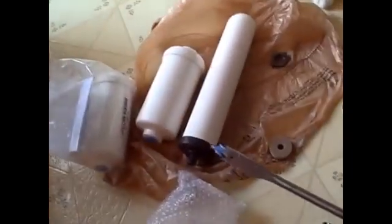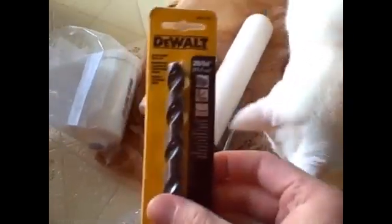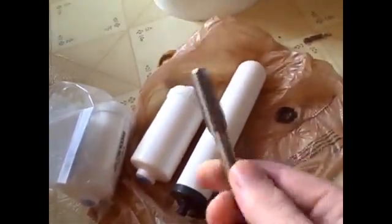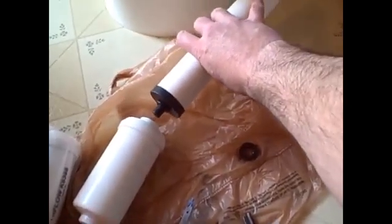I've already got a half-inch drill bit on the drill. You'll need to drill holes in the bucket lid. I'm using a 29/64ths drill bit as a pre-drill — just under size — for the half-inch tap. Then I'll go back with the tap and thread the hole so the fluoride filter screws right in, making the connection through the bottom of the top bucket and the top lid of the bottom bucket.